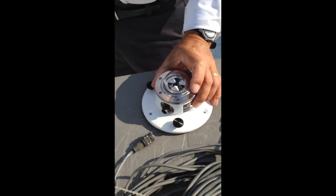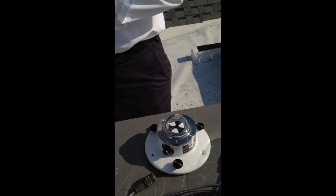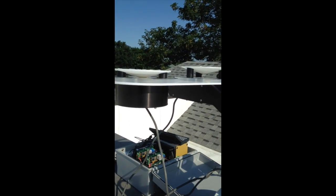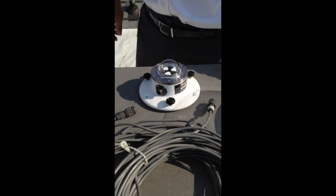To measure the diffuse, we've got a black and white pyranometer that we're going to put on the shaded side of the shade disc cap. You'll notice on the shade disc kit we have some taller standoffs and some shorter standoffs. Taller standoffs go to the 848, which is a shorter instrument than the SPP.